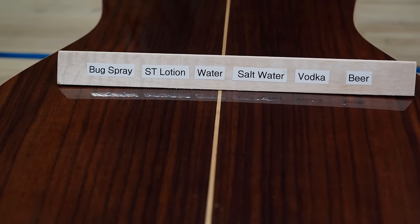Now we move on to our scratch resistance test. We take a ball of keys and belt buckles and rub them back and forth across the back of the guitar for 60 seconds to see how well the finish holds up. This polyurethane finish held up super well, just like we expected, with only some fine, faint scratch marks left behind — nothing that can't be buffed out.